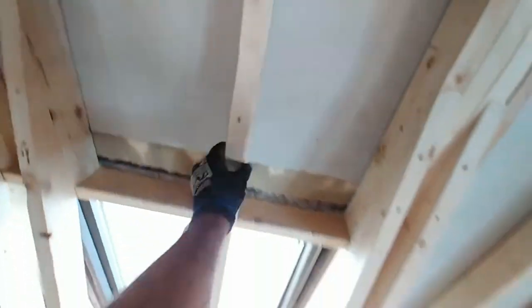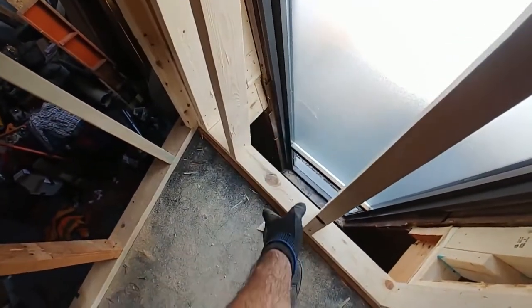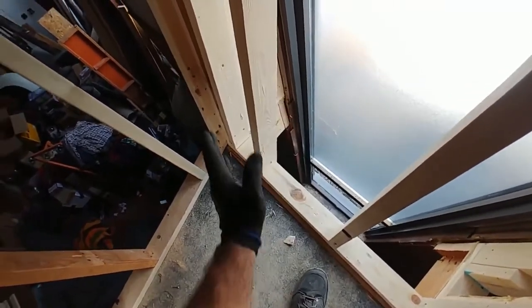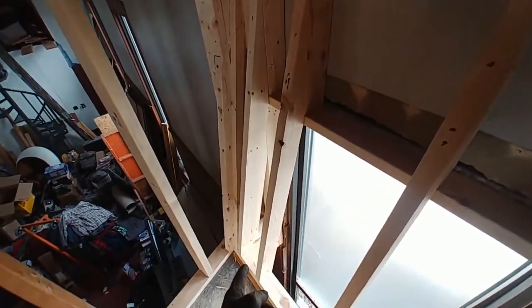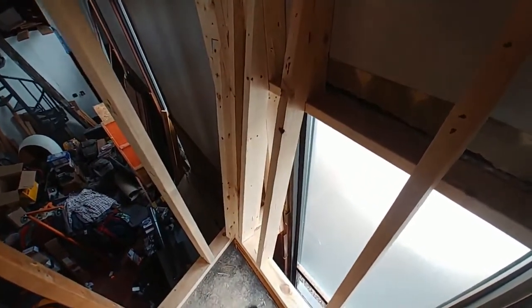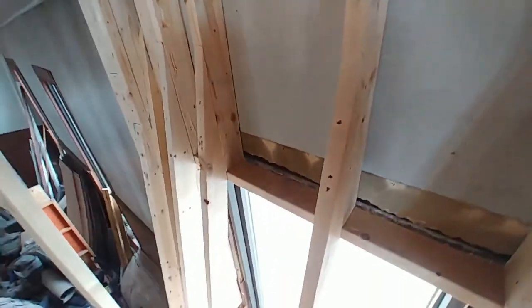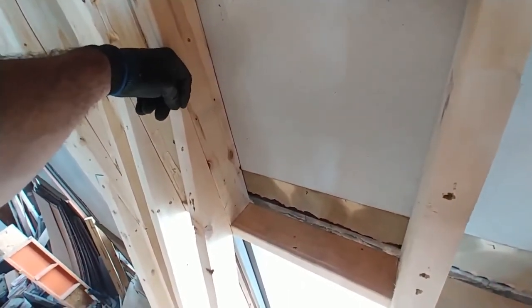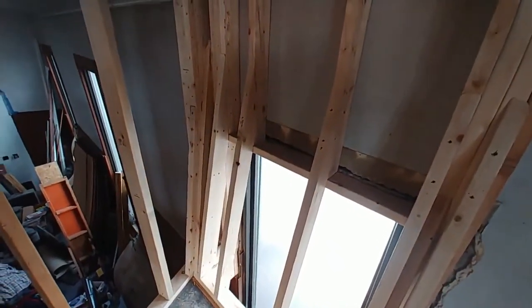And the layout ends up just becoming a stretch. I just figure the angle from here to the inside corner there, because I want that to be smooth and go right on by, is 12 degrees. And so if that's 12 and the back of the theoretical triangle is 90, that's 102, and every triangle is 180 degrees total, so that leaves 78 degrees, which is this angle here. From here to there is 78, and whatever's left of 90 is the rest of it there, 12 degrees or what have you.